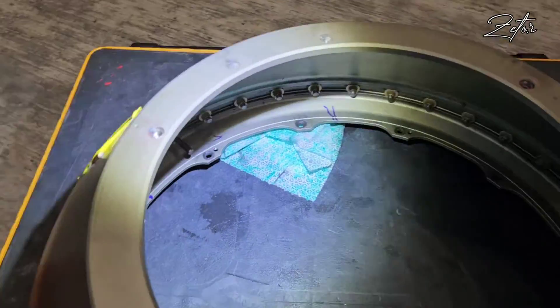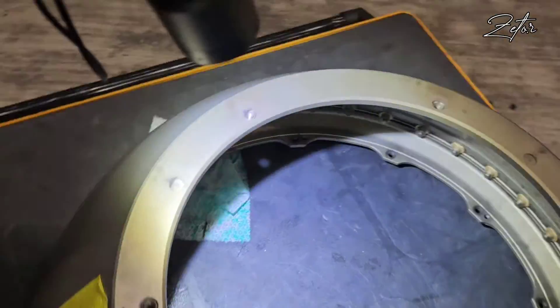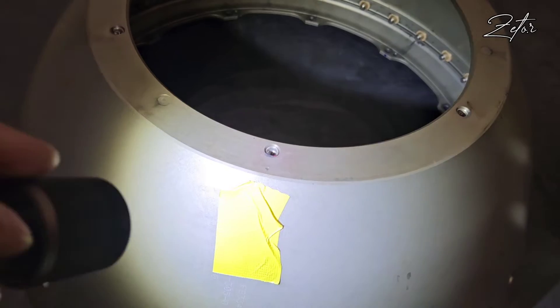For that we need to know the exact position of each blade. Of course we will not be able to balance the disc only with the blades, so for that reason we have balancing screws installed on the rear cone. If we have vibrations on the engine due to damage or rework of a blade, we can swap a bolt with one which has a higher or lower weight depending on the requirements. This is called fan trim balancing.